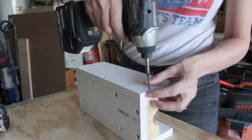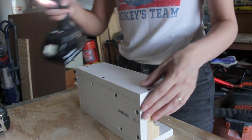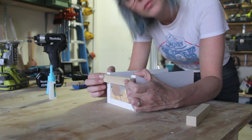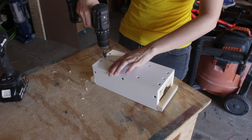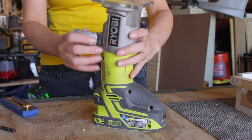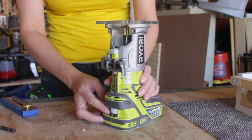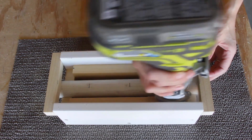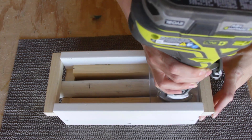Next I cut two 1x4 side pieces from the same trim material used for the base plate and added them to the sides of the jig assembly, held in place with 1-1/4 inch screws. To prevent the router from cutting a groove the entire length of the dowel, I added a couple of stop blocks to the ends of the jig. The last step was to drill holes up through the center of the contoured end pieces, giving me a place to drive screws into the dowel to hold it in place during routing. To cut the groove I used a 1-inch diameter bowl bit, which I found on Amazon — the link is in the description. I started with the bit exposed only about 1/8 of an inch from the base plate of the router.